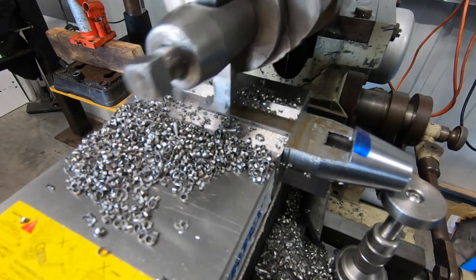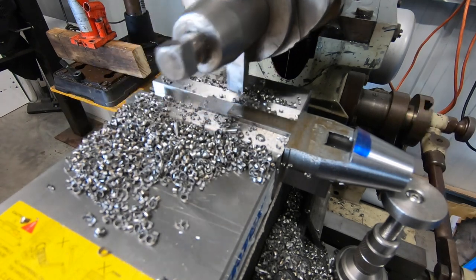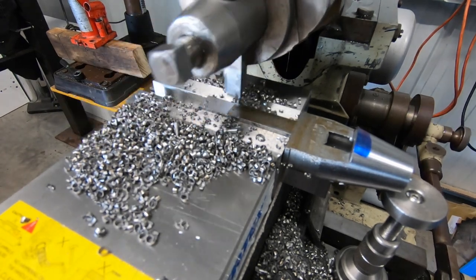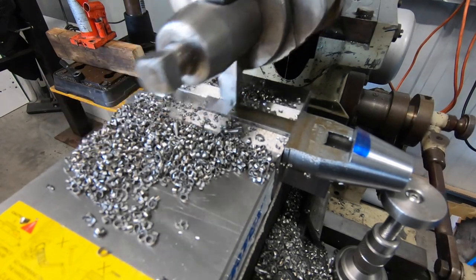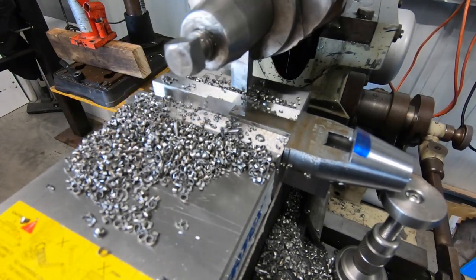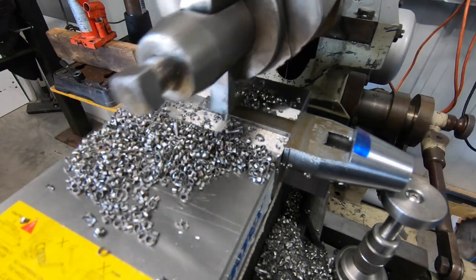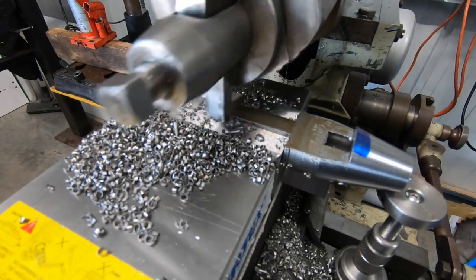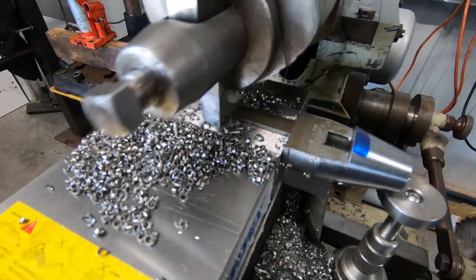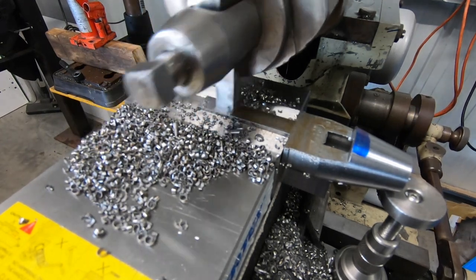This is the second last pass. I had 34 thou roughly to take off. I've split it into two, but taken 25 now, and I'll measure it again and take the remainder. Just put a fresh hone on the tool. Just cutting a lot nicer. I was getting a little dull, quite dull really.